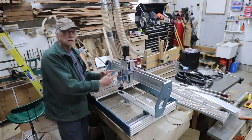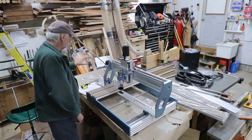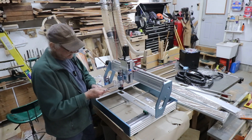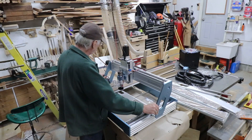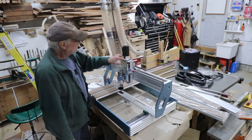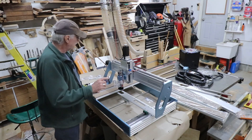You can just lift up the spindle to change tools. So that's my little picture there of that thing. Little dust collection thing, with a little tiny port here. It comes with all the tools you need to assemble it - a set of metric ball and hex keys, and of course the spindle wrenches. Even these have been bead blasted - I think shot peened and then anodized. It's got a really nice smooth non-stick surface. It comes with all the hardware, and interestingly, when you have hardware that needs flat and split washers, the screws for mounting the motors have the washers captured on the screw, so you don't have to go hunting for those. Nice little touch.